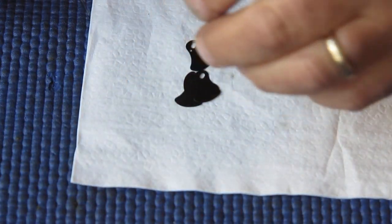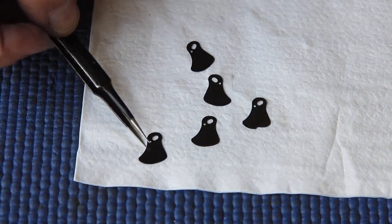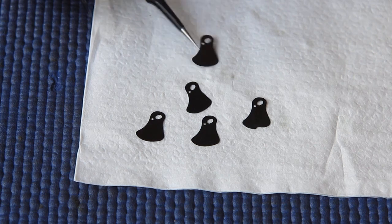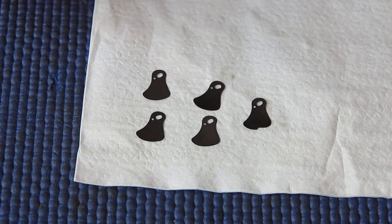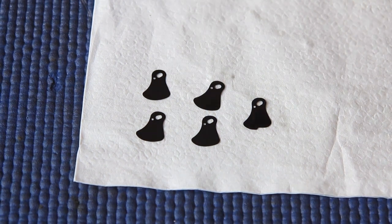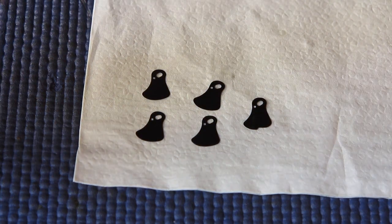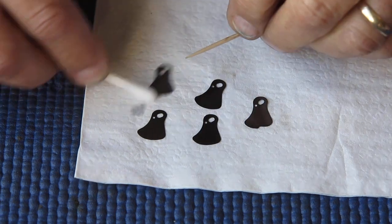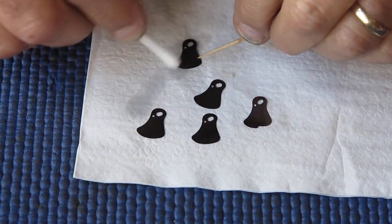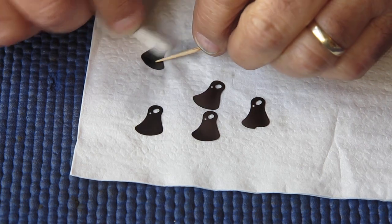Turn my attention to the shutter blades and the mechanism plate over here. So I'll start with the shutter blades. There are marks on these blades. Looks like oil to me. It'll be from where the blades were overlapped and there's been a little bit of oil in between them. The oils typically settle there from elsewhere in the camera or shutter. Now, certainly not put on the blades during assembly. In fact, oil is not usually required in shutters.